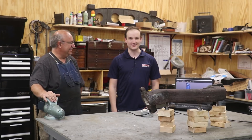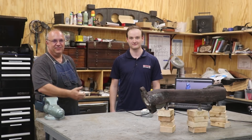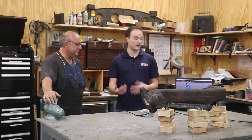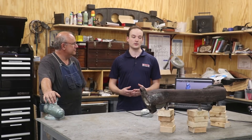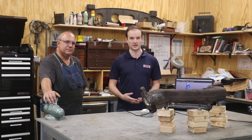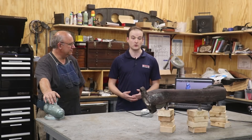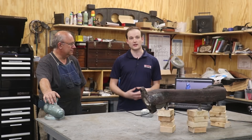It's just blowing my mind — this is really, really cool. The cool thing is after three years, it still blows my mind. Now that we've got this, it's going to kick out a .STL file, which is basically a 3D model that you can send to a 3D printer. My next step would basically be reverse engineering. I would take this into a specialized program called DesignX — it's essentially SolidWorks with a very fancy front end for dealing with massive amounts of scan data. The file I just created was a gigabyte. The STL output would probably be around 150 megs. There are hundreds of thousands of data points to deal with. We'll use DesignX to actually make the CAD and get a very accurate model, basically reverse engineered and archived for future use.